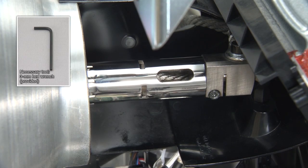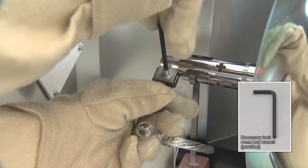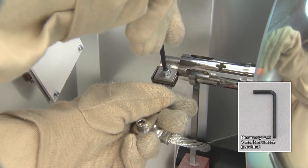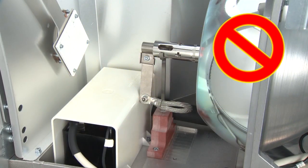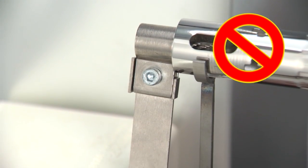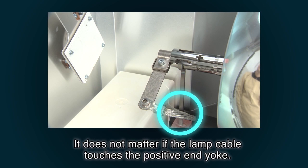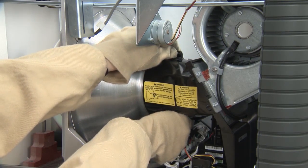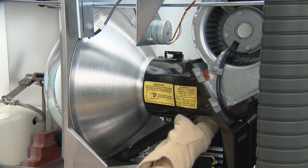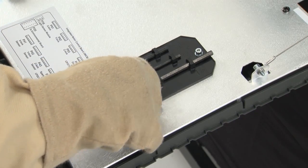Tighten the screw on the negative connector clamp. Place the connector on the positive front end of the lamp and tighten the connector clamp screw, making sure that the positive connector and cable do not come in contact with any other part. Since the positive end yoke is insulated, it does not matter if the cable touches it. Attach the plastic cover and see the note on the plastic cover regarding correct installation. After attaching the cover, make sure that the moving parts inside the cover are not obstructed. Return the tools to their original positions and close the lamp door.